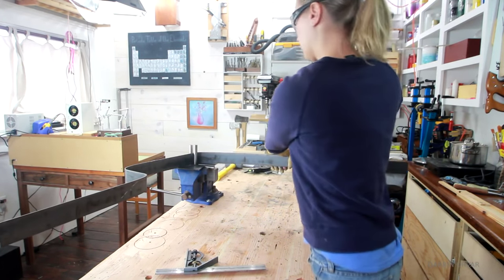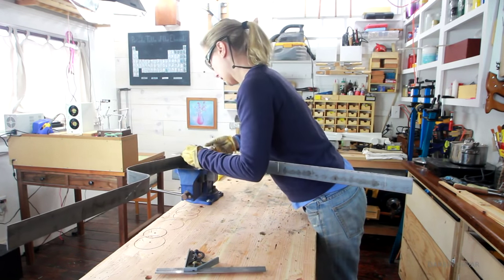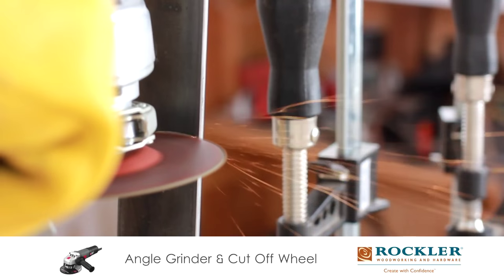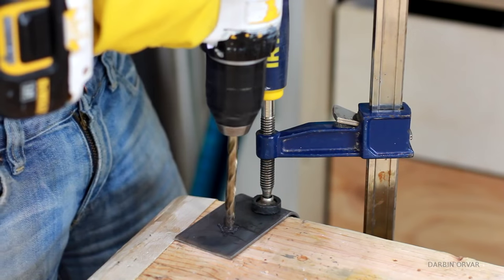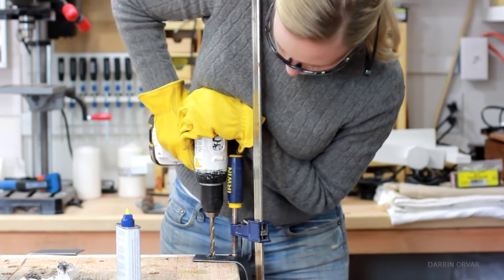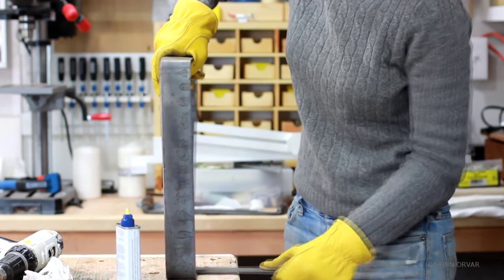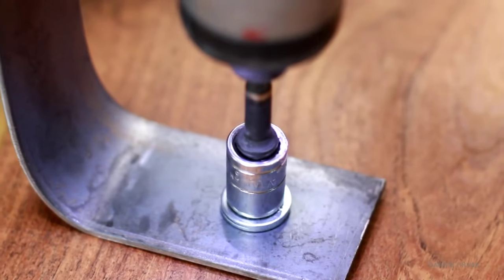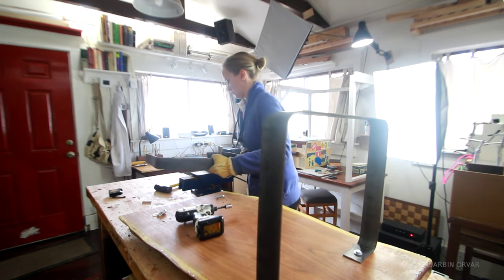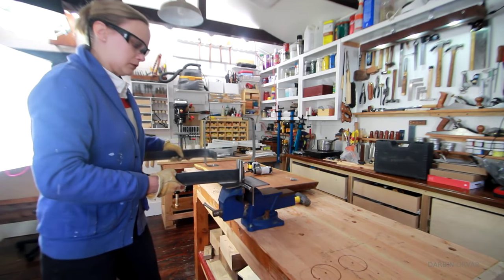So I was doing some tests first, bending the metal on the marks. Then I used an angle grinder to cut the excess off. Then I clamped the steel down and drilled a hole on each end, using a liberal amount of cutting oil to lubricate. I used a 5/16 inch cobalt bit with my hand drill, since at this point I couldn't put the metal in the drill press with all the bends. Then I drilled holes on the underside of the slab and attached the steel with a lag bolt, continuing the process all around. Once I had both legs attached, it was easier to see where I needed to adjust the bends a little to get the base even and straight, so I took them off and made some fine adjustments.